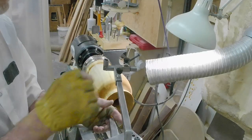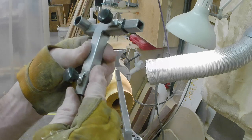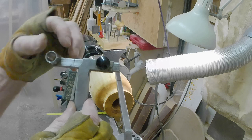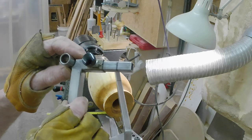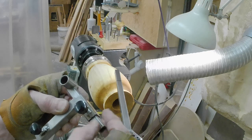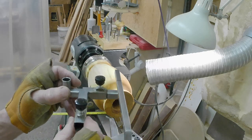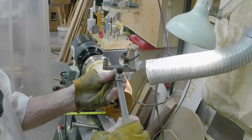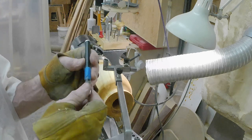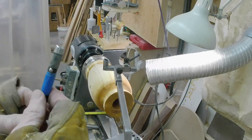The laser adjuster is built from 1/2-inch tubing and 5/8 tubing, and this is a 1/2-inch round tubing, and I just ground that out there so that in case I needed, the clearance would go in all the way there. And these are 10-32 knobs that are available in hardware stores. And so this is very positive XY axis adjustment, and once this goes on the bar, I have some pencil marks on there from the last time I used it, and the laser is a machine brass pointer, commonly available. I bought a quantity of them, very, very inexpensive.